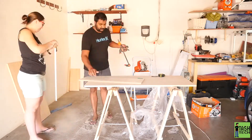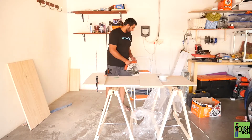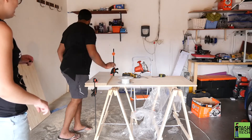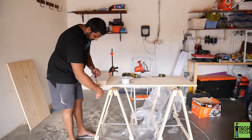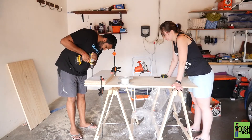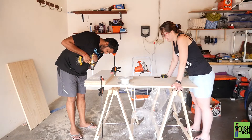This is where I decided I'm not going to paint it black — I'd rather use that as a shelf. So I took the white melamine, ripped it down the center. I used a filament roll spool and just marked the circular half-circular pattern on the board, trimmed off the one side that was a little bit wider than the other. Laid it on top and clamped it together.